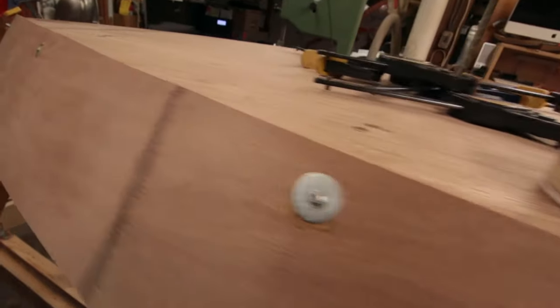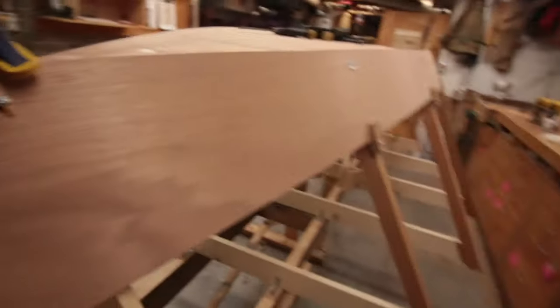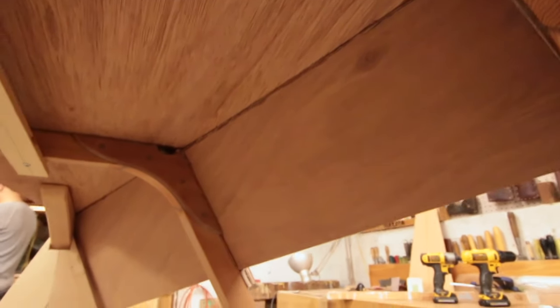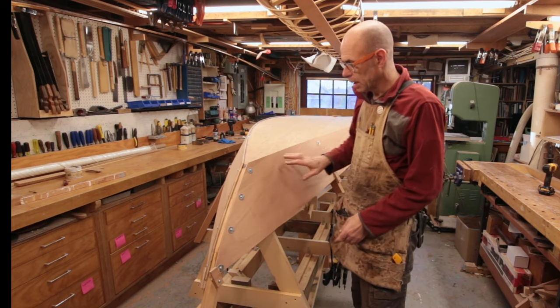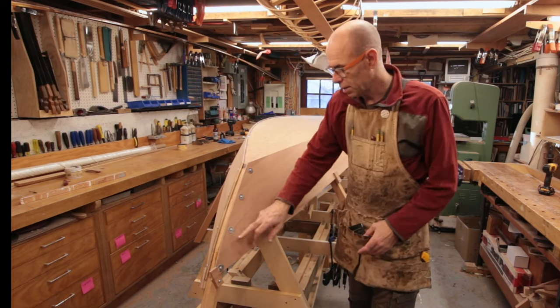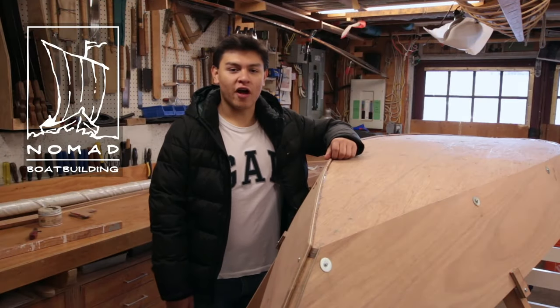We've used some screws here, and in a few cases we've used fender washers under them - probably should have used fender washers everywhere. That just tacks the plank in place while the buttons hold it at the other end. We're going to let the epoxy hold it for now and add fasteners later on. Next we need to think about cleaning all this squeeze out from the joints. I have a golden rule about squeeze out: you scrape it up, don't smear it down. And if you can't deal with it neatly now, leave it alone and you can take care of it with a heat gun later. That was a really successful glue up - everything went together nicely, everything fit. It's been about 24 hours now and I can start removing all of these fasteners - this epoxy is going to hold everything together just fine. Thanks to Michael for coming out and teaching me a little about working on this boat. That's it for this episode - don't forget to subscribe and hit that bell so you know when the next video is out.